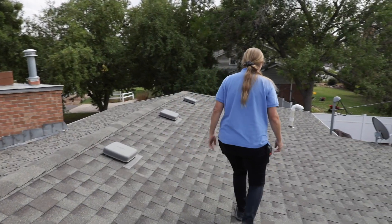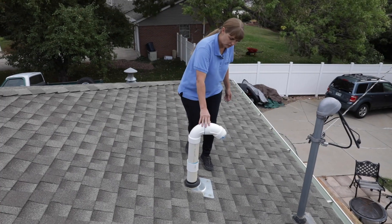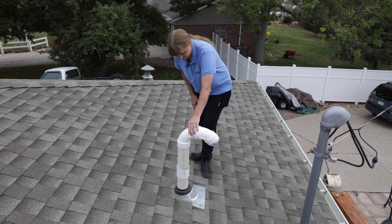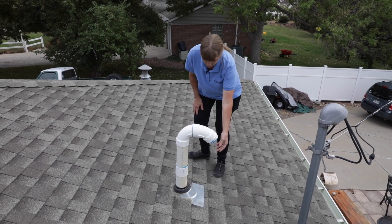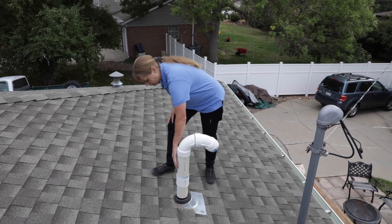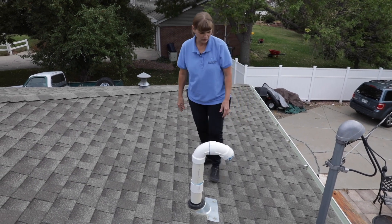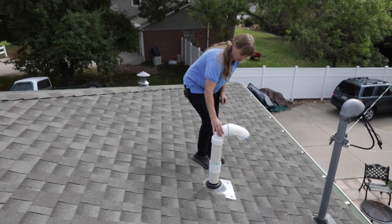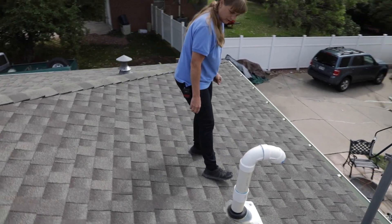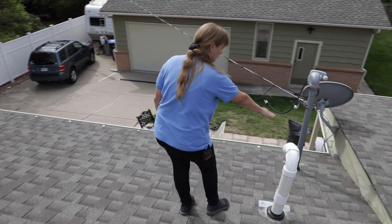As I walk the roof, I'm looking for nails and I'm feeling it. This is for the radon — we know that because it's PVC and it's blown out quite a bit. We just want to make sure it's all sealed appropriately, and that seems to be the case here. The siding is too close to the roof over here, so I don't see any flashing — I'm going to note that. Other than on the top and bottom, I want to see flashing all along here.